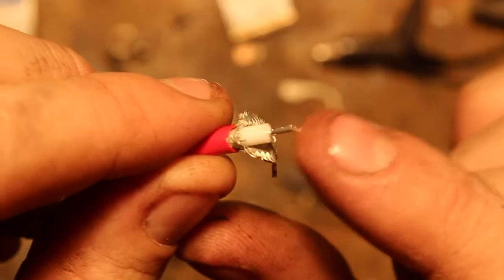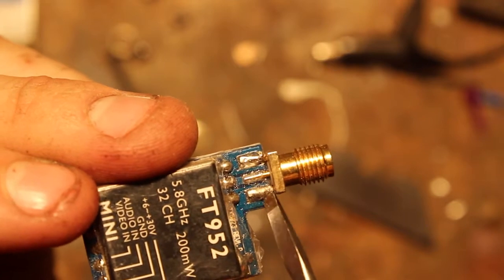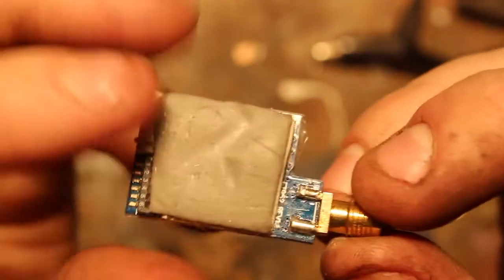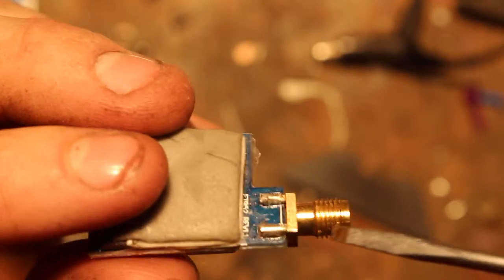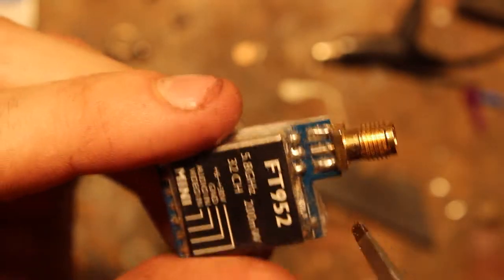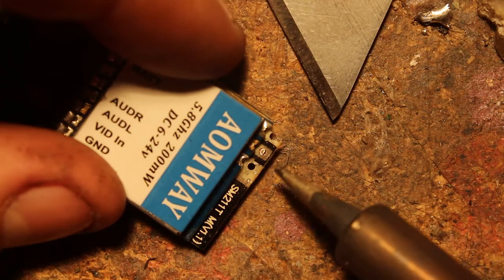And there are our two wires — we've got the inside wire and the outside wire. You can see from the way these are wired up, we have to wire the inside wire to the middle and the outside tube wire to the outsides. Now if you look at this, there are actually one, two, three, four outside connections, but we only need one. These legs are all part of the same copper base, so they're all connected to the same place because they're just the ground. So we have to connect our centre one to this pin.